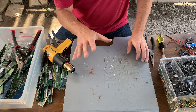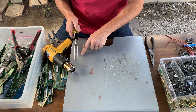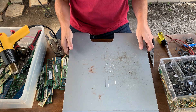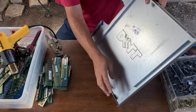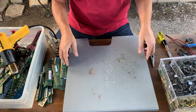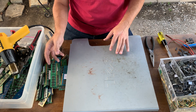The last thing I wanted to say was I like to have a metal surface to work on because the solder drips off and it sticks to everything, and on a metal surface like this I can just peel it off. And if there's any tin or silver in it, it can be processed; if there's lead, whatever. The other reason why I like having this nice metal surface is it protects the workbench. I use this one specifically because it has this cavity of air underneath it — it's raised up on all sides. So as I'm working with the heat gun and this surface gets hot, it's got this area underneath to buffer and not heat up my desk. It's an old Dell tower side panel, and as I'm working it allows me to make a mess out of it, get it really hot, and it doesn't care.